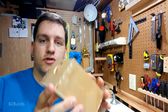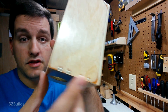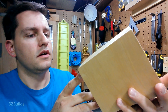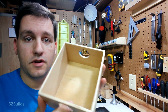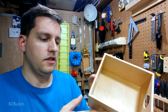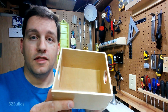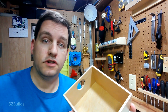Overall, I think these turned out pretty well. The joints turned out fantastic — I really like the look of those variable width box joints. I certainly had my share of mistakes and shortcuts. I got some tear out on the back of some of these boards; I could have fixed that with a backer board or some tape. Sanded down some areas a little too far and went through the top layer of the plywood. But overall I'm really happy with how these look. These are going to fit in great in the battery station — I can store stuff in here and pull them out easily with these large handholds. It's got its imperfections like any other project, but frankly I'm too excited about the box joints to care about anything else. That concludes our variable box joint test — more to come. Thanks for watching, see you next time.